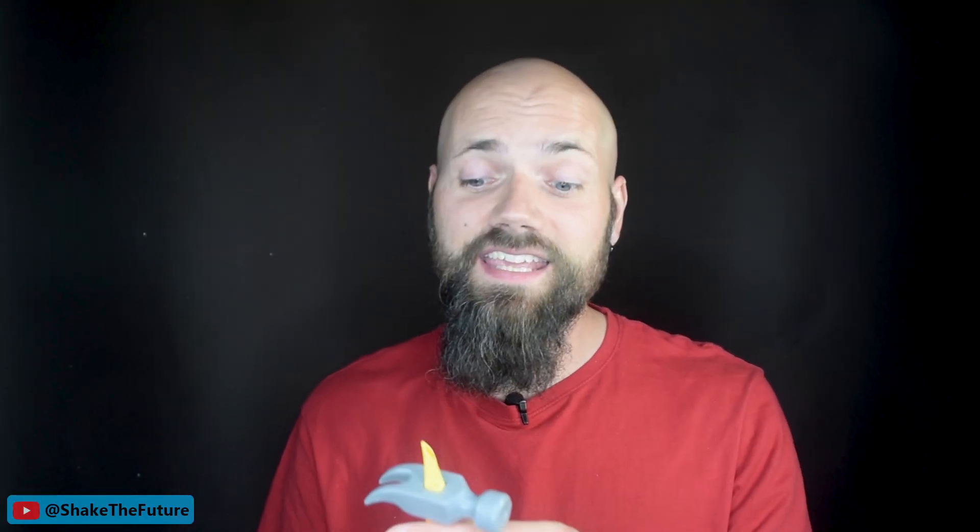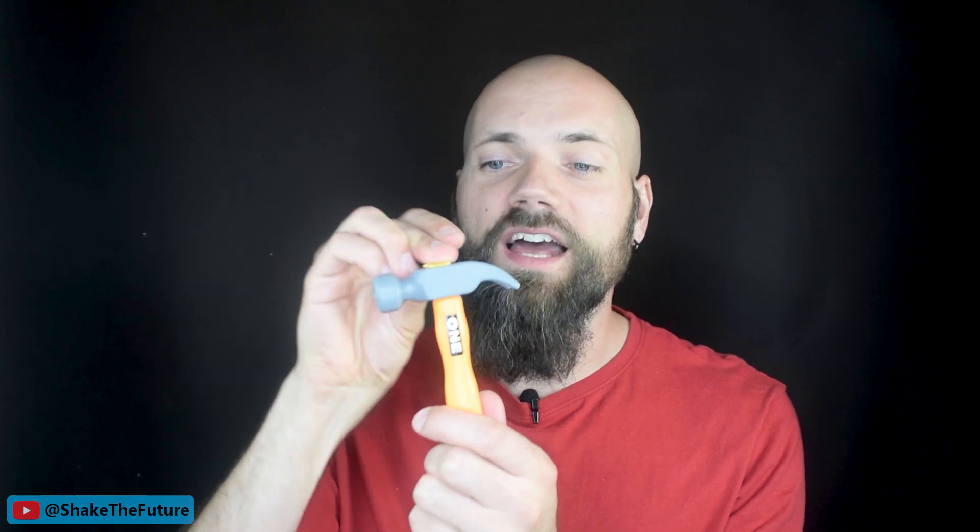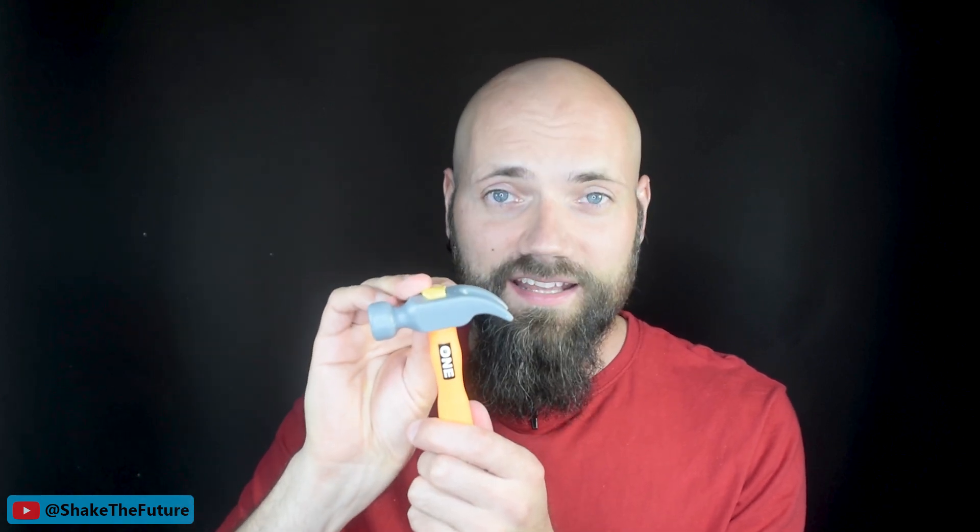So what caused that little hole? I'm not a metal casting expert but I think I needed to make the spout a little bit taller instead of pouring the hot metal directly into the hammer head. Anyway, I'm happy with the result so let's clean it up and try it out.